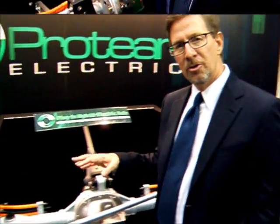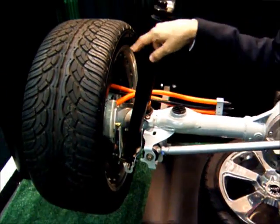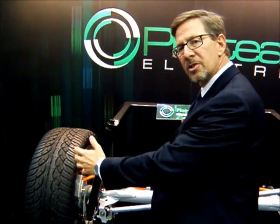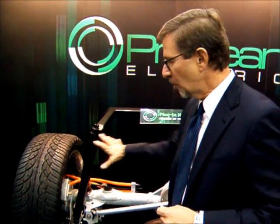Okay, so the last thing you do to help make this into a vehicle is you have high voltage and a control signal and then a coolant loop that's common with a coolant loop that's used for the engine. So this system now allows you to bolt on a hybrid drive system. You can make a hybrid truck or a car from an existing vehicle that's on the road that today is not a hybrid. Or you could even put two motors on and make it a pure electric car. You can size the battery small or big, it doesn't matter.